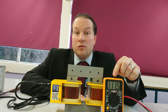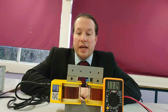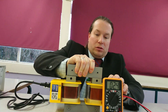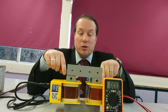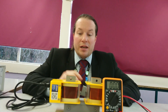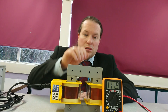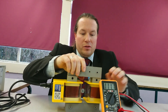If we look at our multimeter, we can see we've got about 110 volts — so we're losing 5 volts somewhere, and you can hear that coming out through the mechanism of sound. Now, if I try and take the top of the core off with the transformer on, you can see it's very, very difficult. The reason is because we now have a magnetic field being induced. With the transformer off, it's very easy to pick up the top of the core. But with it on, it's very difficult — I can actually pick up the whole transformer.